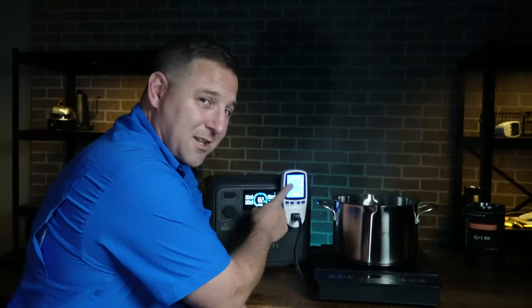I've been letting these two items charge for about 15 minutes now. The battery bank is showing it's pulling 95 watts while the AC70 output shows 92 watts — potentially a small discrepancy between the two monitors. Another observation: pulling around 180 watts from this device, the fans are in what I'd call medium mode. They're not unbearable, but I can definitely hear them.